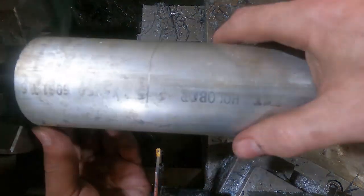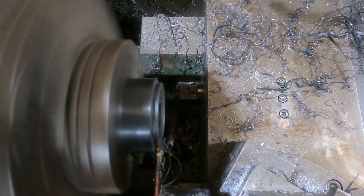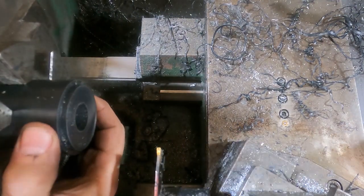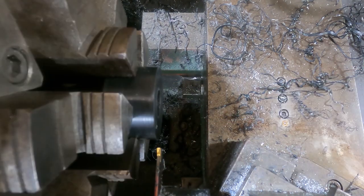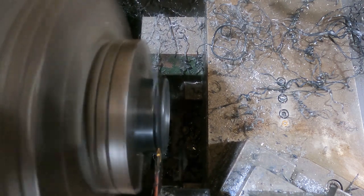The o-ring test fit is very close. This first one is what actually set the 130-thousandth depth — I was basically trial-and-erroring until the part fits snugly. That worked. We clean up our edges, confirm the o-ring fit is exactly what we wanted, then set zero again, clean up that edge, and part off our compression ring. We need four compression rings and two washers; I'm only showing one set. The next o-ring groove goes much faster since we already have our size.